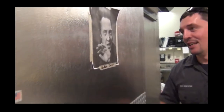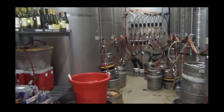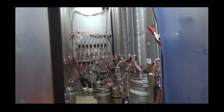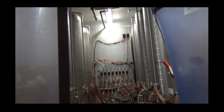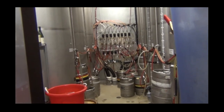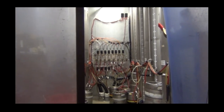Here we are at the cooler. What's behind the door is the more magical part of this whole situation. All the beers are actually served from these tanks — these are 868-gallon tanks. They're like big kegs, really — they get sent down through ports on the bottom and sent all the way back to the back wall. Those black boxes are actually beer pumps that help push the beer all the way to our bar. We actually cool those towers down — there's a line of glycol, which is a coolant that follows the lines all the way, keeps the beer nice and cold, fills up the tower with glycol, and a tube runs right through with the beer. So you have a nice cold beer all the way through.